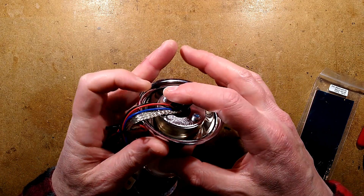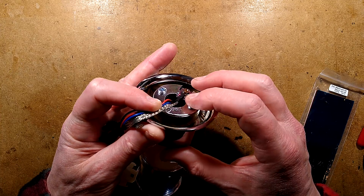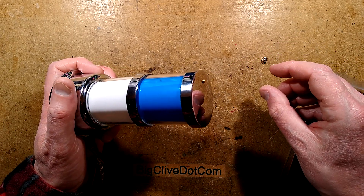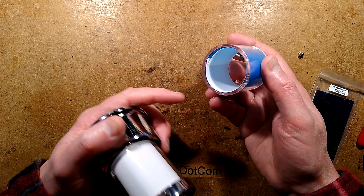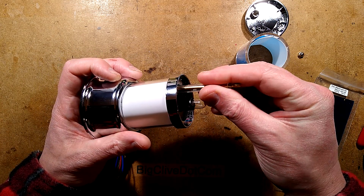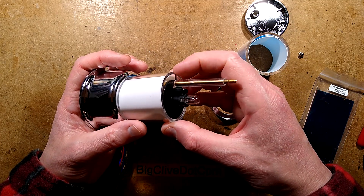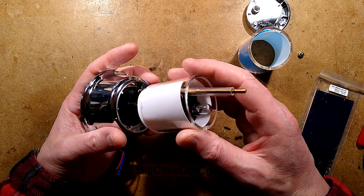To mount this on top of the machine, there are two built-in threaded inserts with screws that go in from inside the machine. Strangely, you can remove this dome nut from the top and take the top cover off. Then you see the first layer of filter — note it's just wrapped round inside. Here is the central metal core with an insulating shaft on it and the first tungsten lamp. If you remove this, there's a little metal tang here — this is to ground that metal layer.